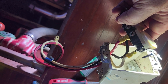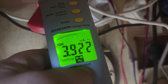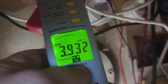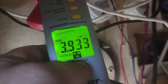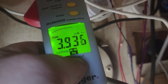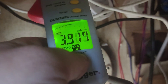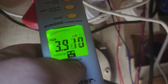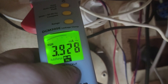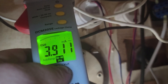Everything's back together. AC is running. We used to have around two to four amps of leakage; now the whole system on shore power is getting 3.9 milliamps — that's fantastic. I believe the ELCI trips at 30 milliamps, so we've got tons of room. The multi-plus two is on, AC is on, battery chargers times two are on — the only thing not on is the water heater. Pretty much everything is on and I'm very happy with that.